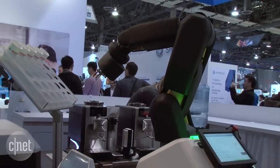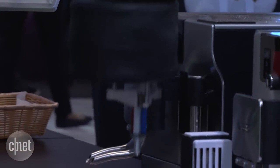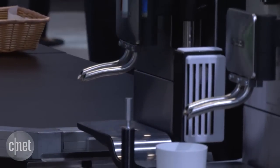This is an industrial robotic arm, so it comes with a capacitive electric field. If you come within three to five centimetres of the robotic arm, it will actually stop — so it protects you. This also means that the robotic arm can operate outside of a cage.